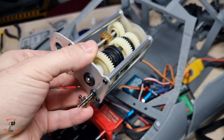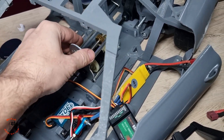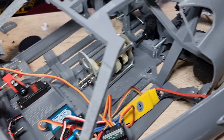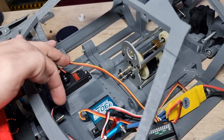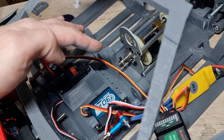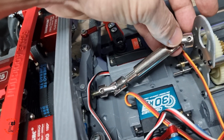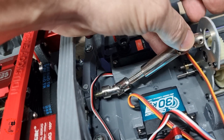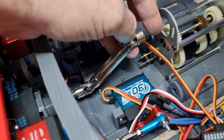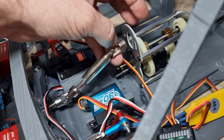The manual transmission is all assembled. I'm gonna make a mount and put it here, giving it some space so we can put a dog bone over here. With the front part I'll have to put a drive shaft so it can connect with the clutch and the transmission. I'm thinking of using a drive shaft that can move — so whenever it clutches it can flex and not be fixed. I'll also need to make a bearing mount.